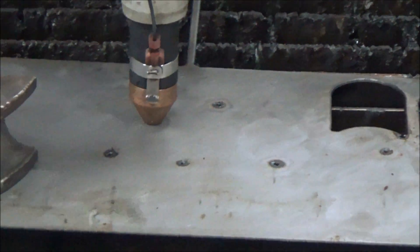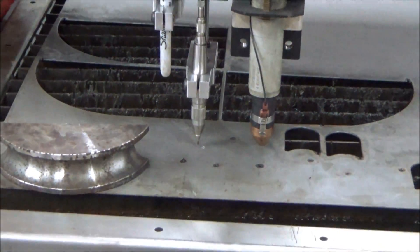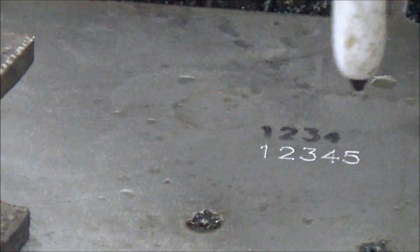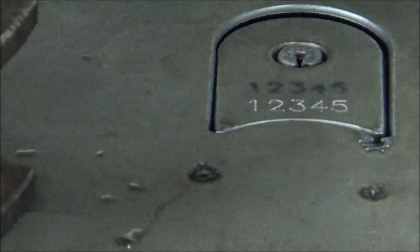It's touching off — finding the top of the metal for the scriber. Now it's going to make the noise. Notice it's not shocking the scriber into the ground — it dropped it, but then it smoothly lowers it. That way we don't have a problem of scribers blowing up. She's going to cut here, so shield your eyes a little bit if you want. You can see how nice the scribe is right there.